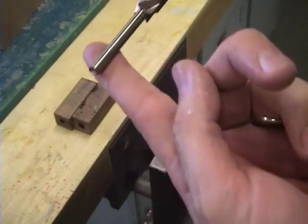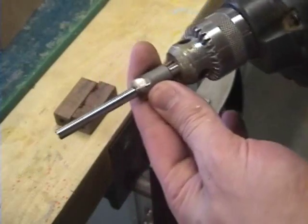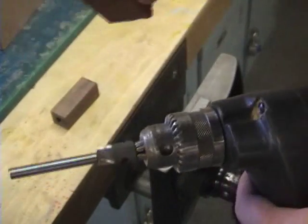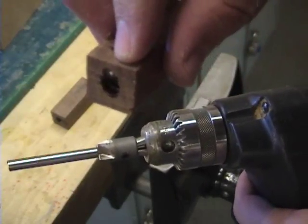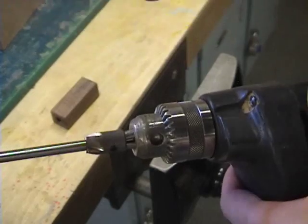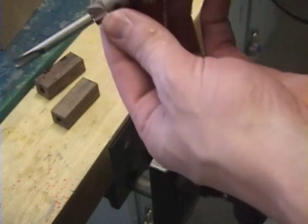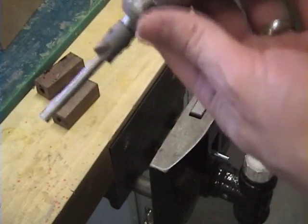So that's why I was saying not to worry about all that foaming up. And then this larger diameter part here shaves down the wood until it is flush with the brass tube. If you don't flush it up, then later on you can have problems. Okay, this is an old drill, and the only thing I use it for is this particular bit. We never take it out.